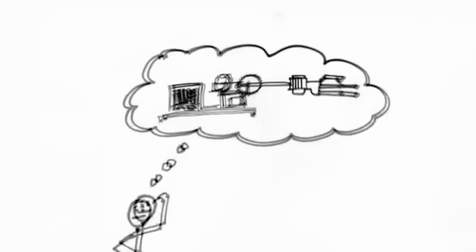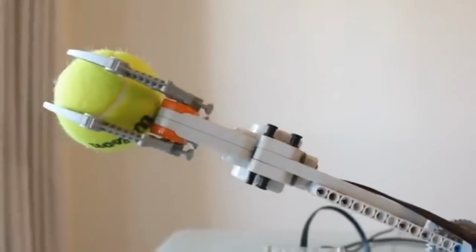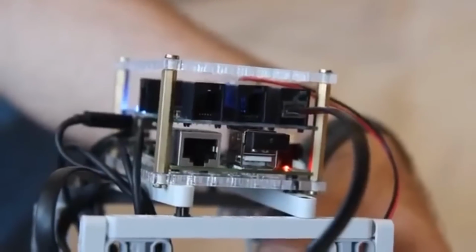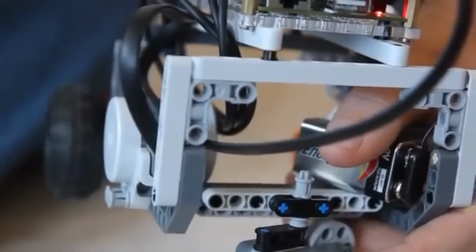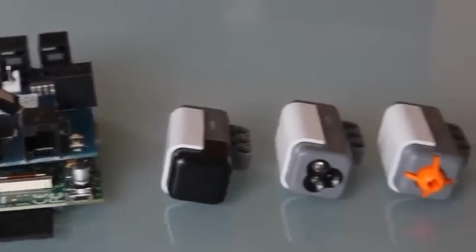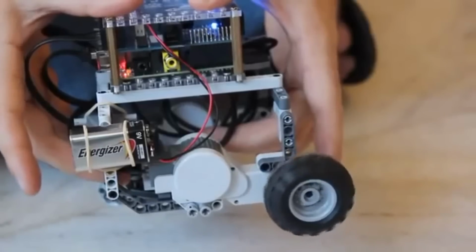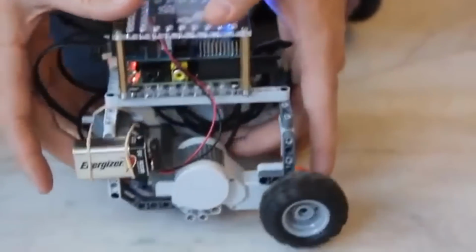If you can dream up a robot, you can snap it together. Lego makes building the robot easy. The Brick Pi unites these two systems together so anyone can make an awesome robot. What makes it so awesome? The Brick Pi has three motor ports that power standard Lego Mindstorm motors and read encoder values back. There are four sensor ports for connecting Lego Mindstorm sensors like the touch sensor, color sensor, and gyroscope. The Brick Pi has two LEDs to add visual life to your robot. A 9-volt battery power source powers the motors, sensors, and Raspberry Pi, untethering the Pi from the wall socket.